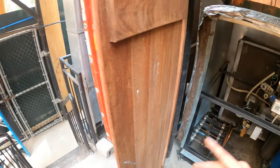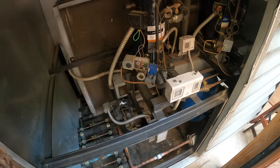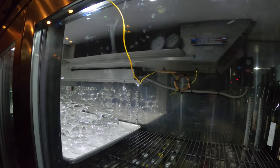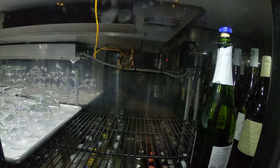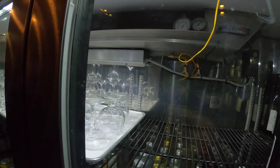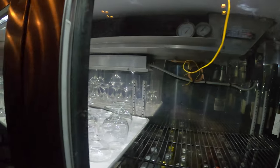From here they send a bunch of pipes towards the kitchen and bar areas, and pretty much the thermostat works the solenoid valves. The system is operating — we're going to give this thing some time and let's see if that temperature satisfies in the right place. Temperatures are definitely coming down — we're at 52 degrees, 51.8. We're at 47.8 — just going to wait for this to drop to the right temperature and for that solenoid to close. Pretty much that was it: we had a short, we found it, got rid of it, changed the thermostat, and we've got two boxes running. If anyone found this video interesting or helpful, please drop a like, comment and subscribe — new videos every week. Catch you all next time!